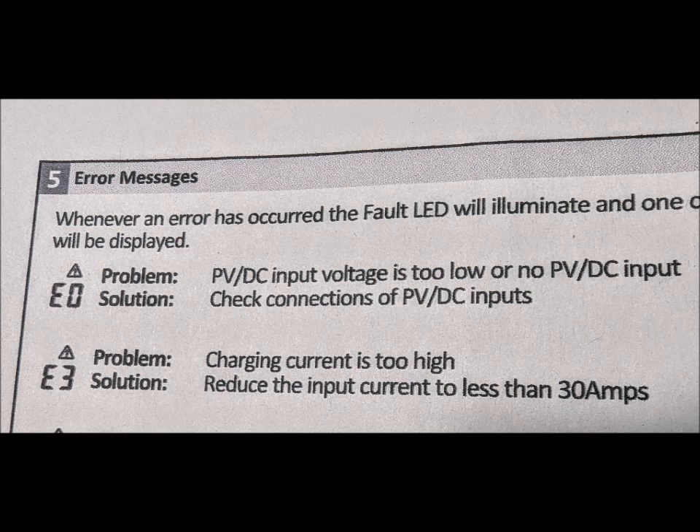My charger says it's a smart charger but it's too clever for its own good. When I connected the cables it detected some change in resistance and it's now giving an E0 error code. But it's nothing to worry about — it just means it's detected there's no input from the solar panels. As soon as you connect the panels and there's input from the sun or daylight, the error message goes off.